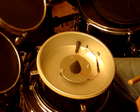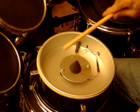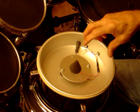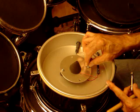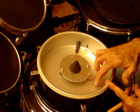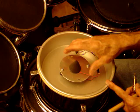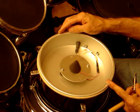If you're fortunate enough to have a drum module that can detect positional sensing, like the later model Rolands, this is pretty much how the Roland pads are made. The new Roland pads with their drop-in basket use the same concept — the trigger is centrally mounted, the rim trigger centrally mounted, so they're equidistant. You do need to isolate your main head trigger from being hard-mounted to the same place as your rim trigger. Some rubber or foam rubber tape would work — some way of slightly isolating the head trigger from the shell, which is effectively your edge or rim.